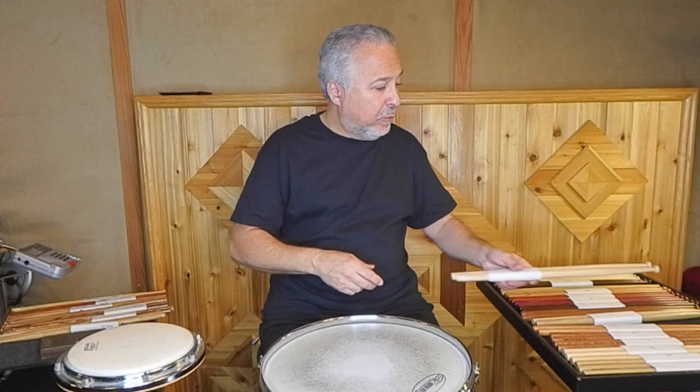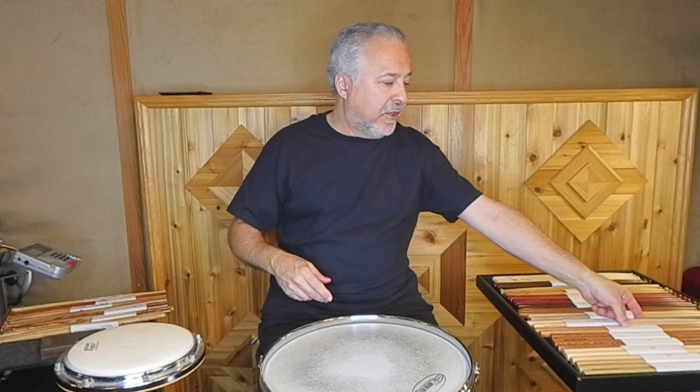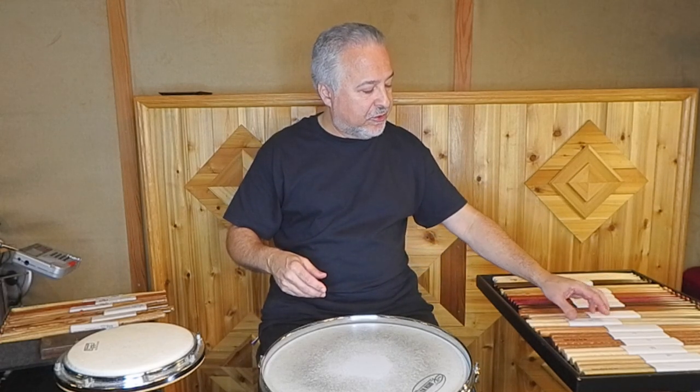And if they're going to be warped, you can roll them. You know, you can do that. It's kind of rare these days, but none of my sticks are warped. I learned that lesson a long time ago because I dry them to 5% or less, which is quite the achievement when you're talking about getting wood really dry without it checking or cracking. I have a whole process I use for that. But some of this wood's been sitting there for 10 years. Like I said, the pecan.